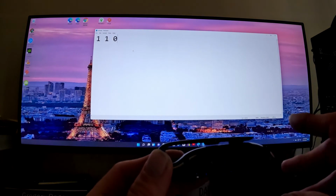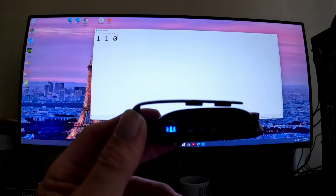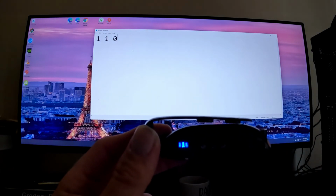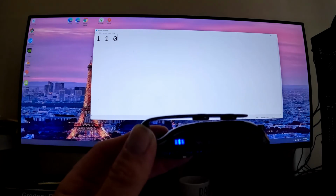So after we get all that onto the SD card, we disconnect it from the computer and power it on. The first time you power it on, it takes the information that we just typed in there, the numbers we changed, with the time and date stamp, and puts it onto the unit. So it'll have the correct time and date on it, and the new settings for the high resolution and the timestamp off.